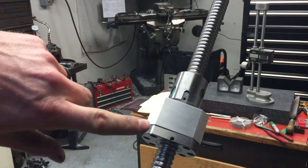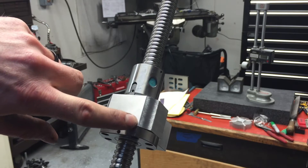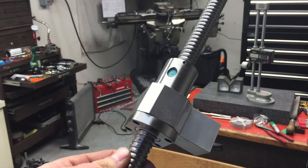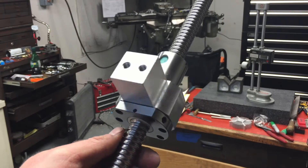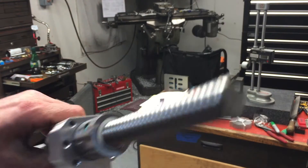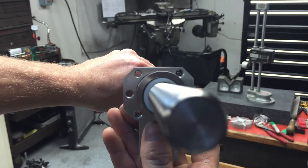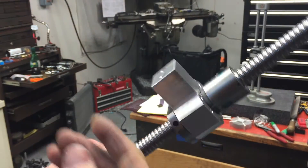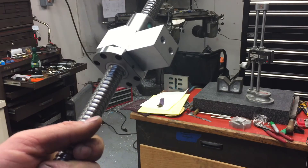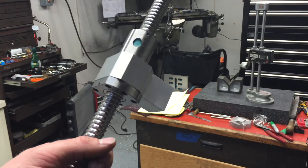Haas has got this figured out — you can see the lines even line up here. He called for a 375 thousandths taper there, and man, that puts that guy right on the money. Pretty typical — all of his stuff has just been great so far. Cool looking mount. And let's see if the holes line up. Yes, they do. His blueprints don't lie, and neither do digital readouts, provided you're doing your math properly.